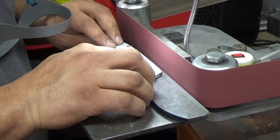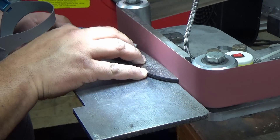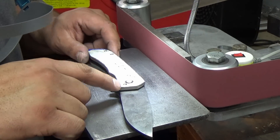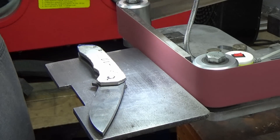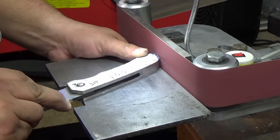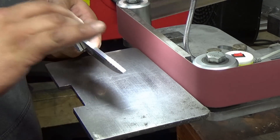What I'm doing is I'm not holding it in one spot — you want to keep it moving. I'm rocking it back and forth like this. Including the blade, I'm just going to slide along and follow that blade. We still need this template so you want to make sure you use the crappy side of the template first. I purposely set it up to slide along the back side. If this template is gone, put a piece of tape or you're going to scratch up that titanium a lot. Use full motion — start from the tip, follow the whole thing and bring it all the way back down to the back. I'm going to keep going and do this until I get about a 400 grit finish and change out the belt.